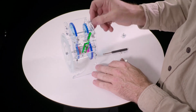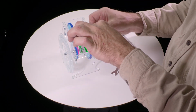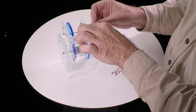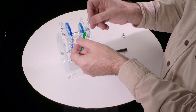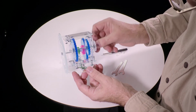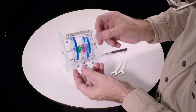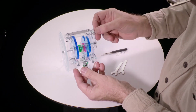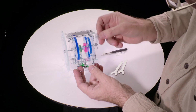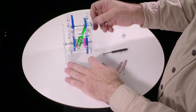So you crank it, and to shift it, you move the shift lever like that. That's low gear, L there for low gear, and H for high gear. And when you look inside, you can see how that clutch disc in the middle is shifted. When it's in the middle here, it's sort of a neutral. And it comes over here, it engages with the other gear, and now it's back in low gear. That's neutral and high gear. And that is the acrylic functional 2-speed transmission.